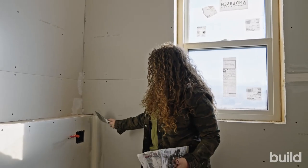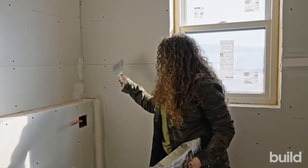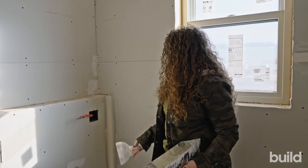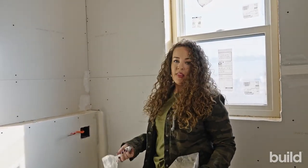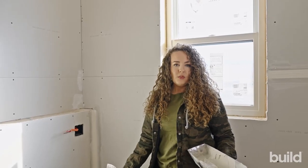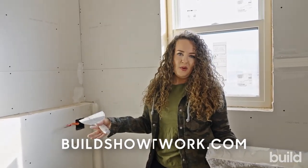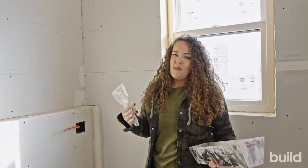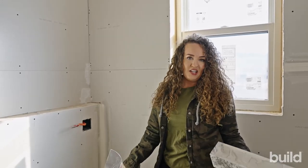That's how we hand tape an angle. If you have a three-way, you just come in and lay the tape on top of each other — this angle tape would go over the flat we just did, covering that cut edge, enveloping and sealing everything. Again, don't coat it until it's dry — it needs time to shrink back. Anyway, that's it for this week's episode, a crash course in hand taping. We'll get into more of it later. Check out all the contributors on the Build Show Network. I'm Drywall Shorty on YouTube, TikTok, Instagram, and Facebook — check you next week.